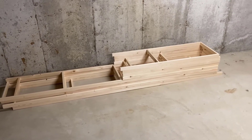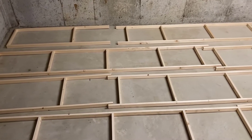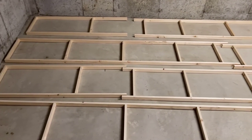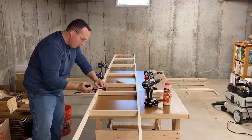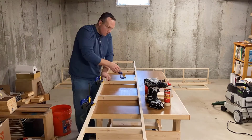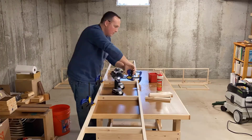Here I've got the web frames all assembled in their individual pieces. Now I just lay them out and add the little splice pieces that put each one together. Notice how I'm staggering the joints — one shelf to the next, I don't want all the joints in line because that's basically saying 'break here.' So I try to space them out and alternate them every other one. I'm just using drywall screws and clamping them together. I did add a little bit of glue for some extra insurance — don't know that it's necessary, but it's there. These splice pieces are just offcuts from when I cut the pieces originally, nothing fancy. Just making it work and making sure it's structurally sound.